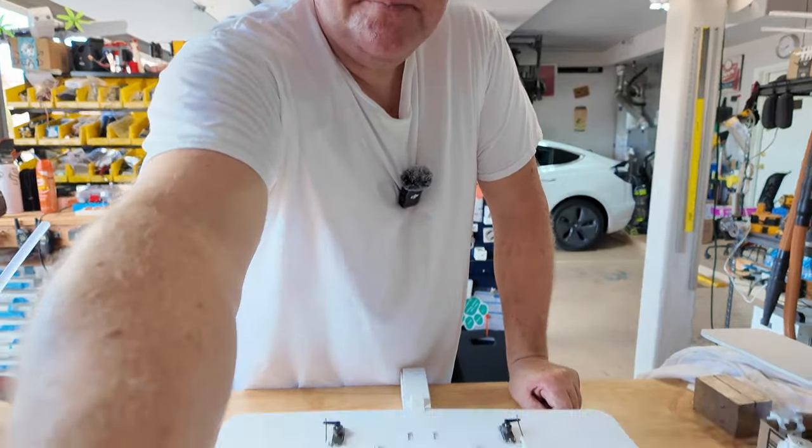Now, I told you about the composite assembly on the tail. Where I was really referring to is this interface point. What we're gonna do is use the hot glue, and secure this portion on all four sides, but we're also going to run some hot glue forward up like this. The reason being is this will form a doubler that we will square up just like this, bring down, and square to the leading edge. Hold that just like that, and there should be about a millimeter or so gap at the front.